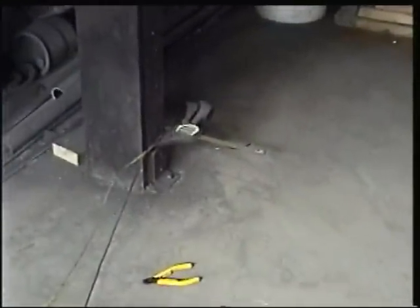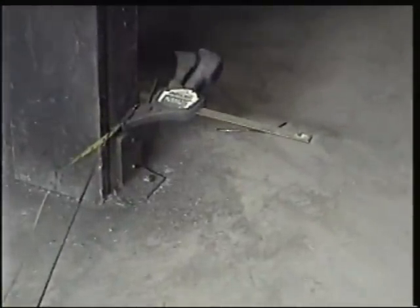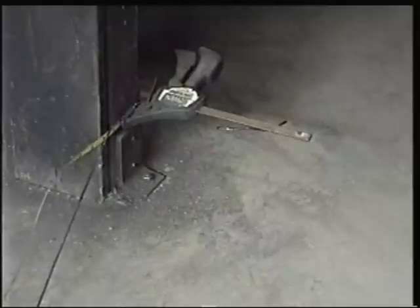Archangel suggested I try building a 75-meter antenna, so that's what I'm going to do today. He sent me an email saying make sure you cut it a little longer, so that when you fold it back on itself and twist it for the ends, it ends up being 65 feet. So I'm going to cut it 65 feet 3 inches, twice.